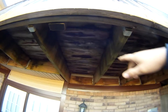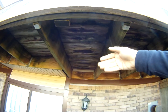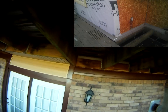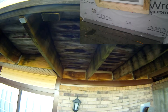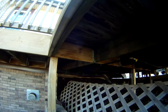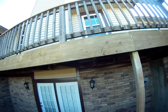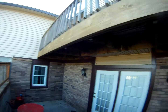What we did is, you see that gray up there, that gray is the flashing that flashes up behind the siding system. That way as water comes down and over, it then goes on that rim board. This metal is actually flashed out above the brick. So water rolls over, under, onto the metal, back out, over onto the brick. There's no way for penetration whatsoever. We carried that all the way through underneath the deck, where you see it flashed underneath there as well. She's bulletproof now.